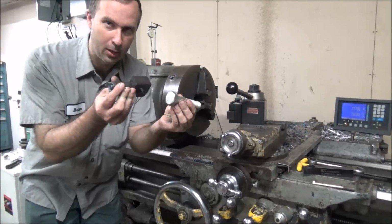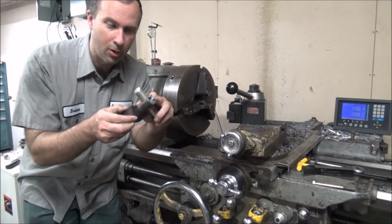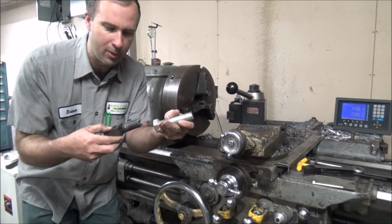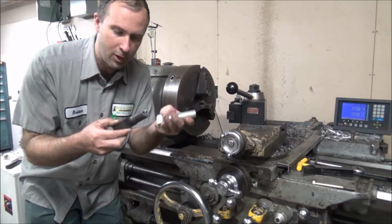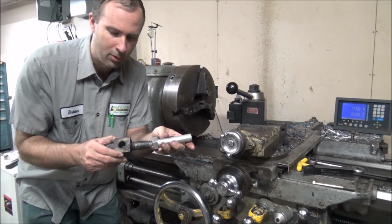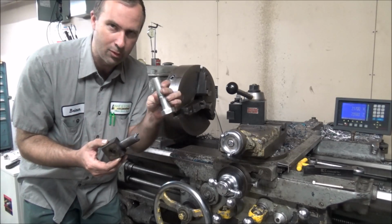Today I'm going to repair this drill piece. So all I'm going to do is turn this point on here and do the same on this, and then I'll be ready to put them together and weld them up, and then I'll turn it back off and should have this fixed. So it'll be a nice quick repair for this piece with a good strong thread on it because we're using a grade 5 bolt.